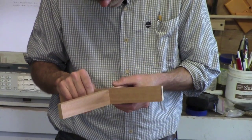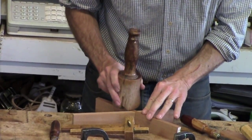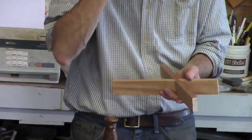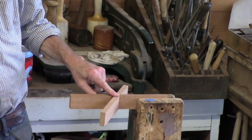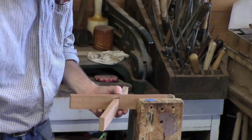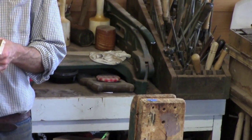That's almost down all the way — that's what it was. Now, the top of this has a slight arc to it, and what I would do — at least what I think I would do — is to do your joinery first, and then put the arc on it later, because it's a lot easier to mark this stuff out on a flat surface than a curved one, and you're not going to affect the joint at all.